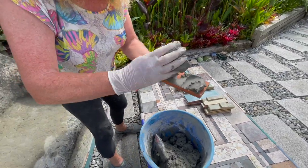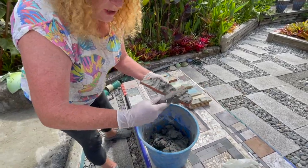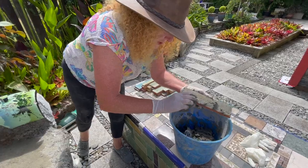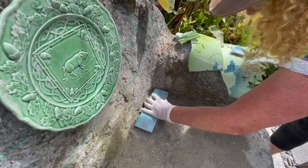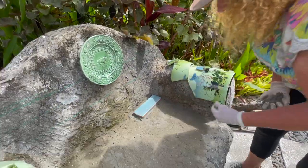You can do this any way you want. I mean, it's just like buttering. I'd probably want about that much. In theory, you should be doing it with this, but I'm just real hands-on. Even though I've got the slope right, I'm gonna go thicker on the back and thinner as I get to the front, just to reinforce the fact that the water's gonna drain. Now, I already know that 3 of these are the perfect width, so I'll bang on 3.